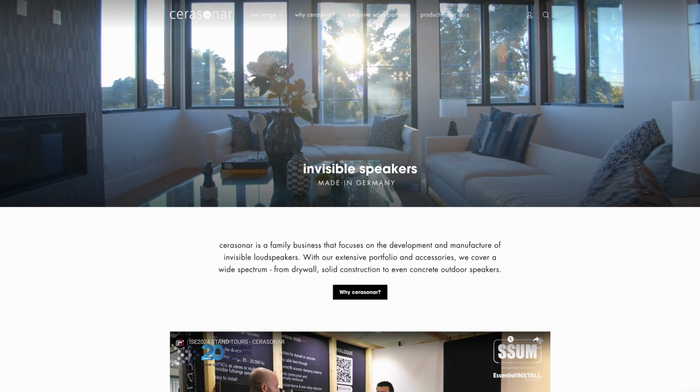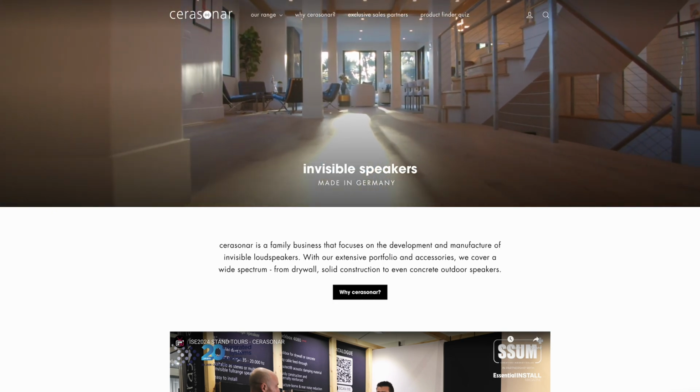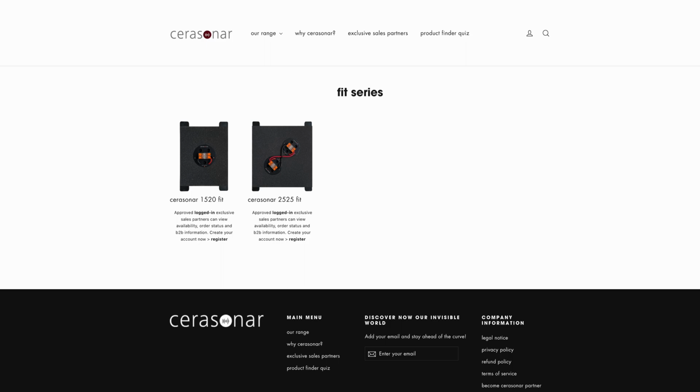And so this is a bit of a run through for you just on what the ranges offer. And we're going to start with what we call the Fit series. The Fit series is designed as an entry-level background music, easily retrofittable style speaker. They're really good for light commercial type jobs where background sound is all you're looking for, a little bit of background music. Ideally, you would always run a woofer with these, a subwoofer with them, so that you get a full range. But they are a very versatile speaker in that they are also weatherproof.